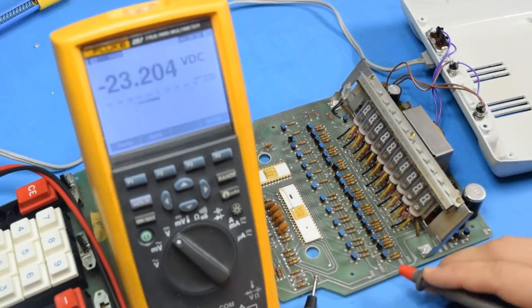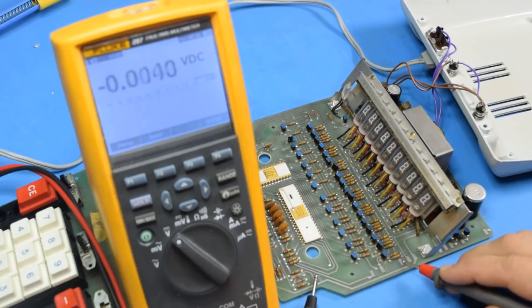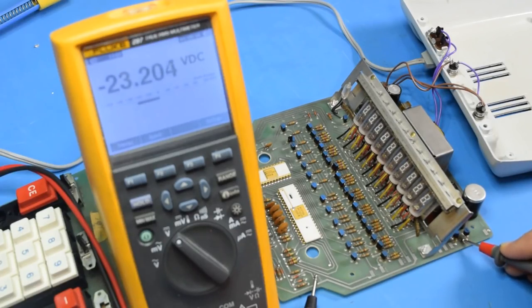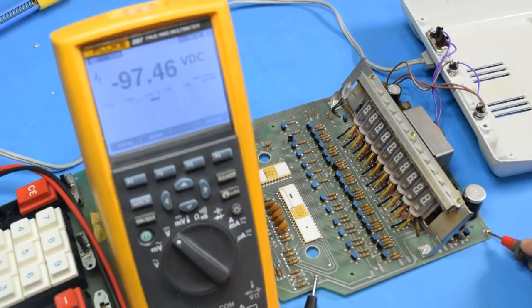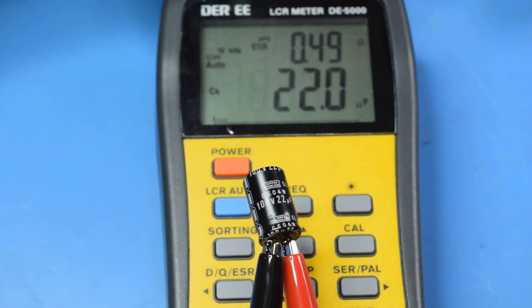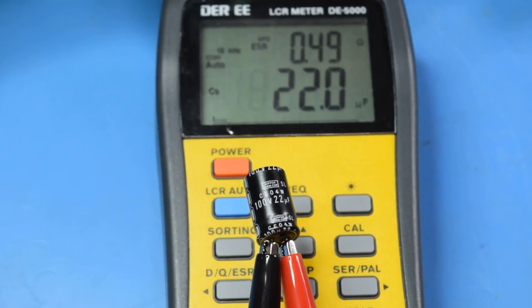It's in the CPU. So, that's a lot harder to try and fix, but I can start by checking all of the voltages on the board and seeing if they're good. If the CPU is not getting the right voltages, then it may not be able to work correctly. Unfortunately, all of these voltages measure close enough that I wouldn't suspect them to be the problem. The voltages should be pretty out of whack if the capacitors had problems, but I went ahead and pulled a couple and measured them anyway, but they all seemed perfectly fine to me.